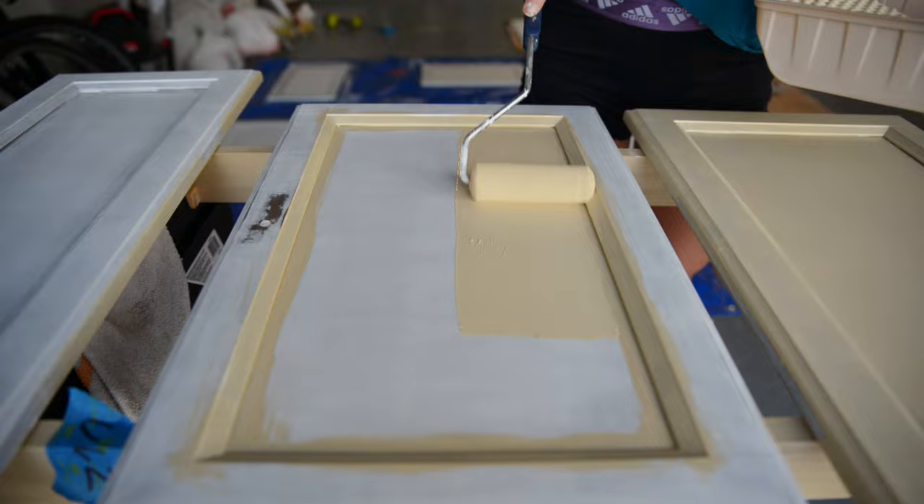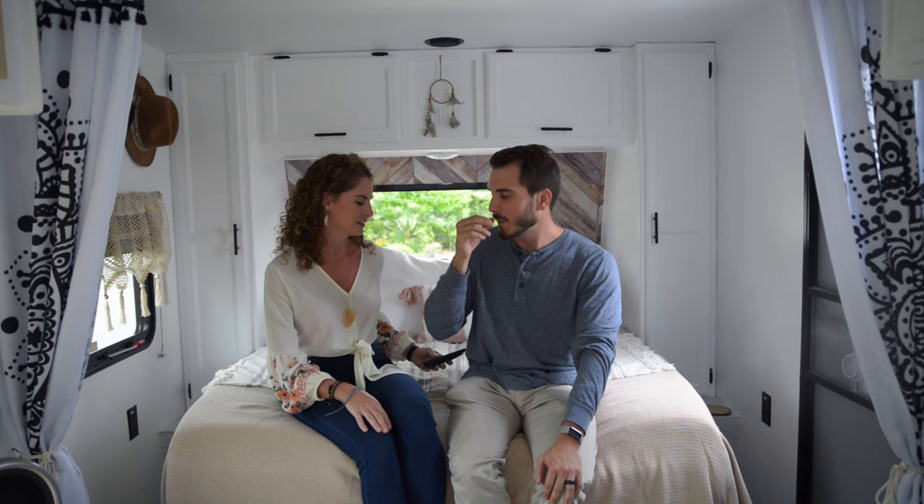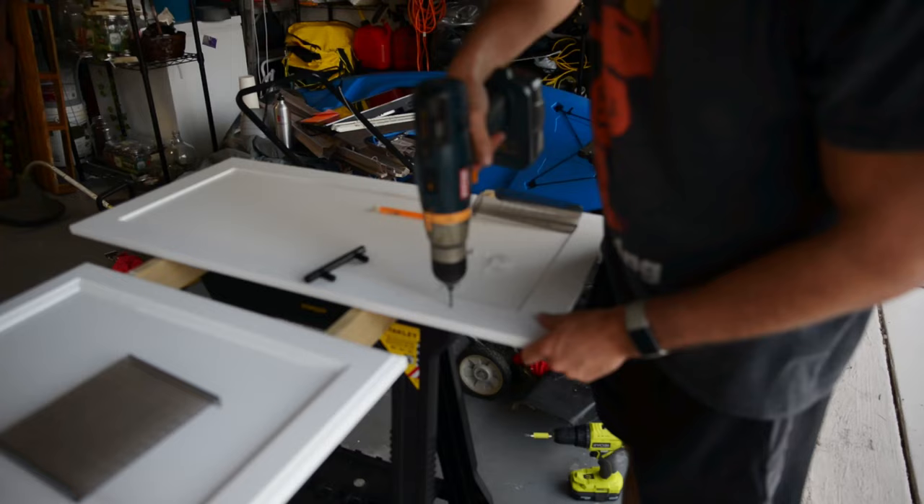Step number nine: after making sure everything was smooth, we added our two coats of paint. It was two coats for the off-tan color, but for the white it was more like three to four coats, and we even had to touch up more than that in some spots. White was a longer process — it doesn't have the pigment that covers as well, and our cabinets were very dark before. The paint we used, I wouldn't give it a huge recommendation — I'd do more research and find something better. It was something I came across on an RV blog and I feel like our lives could have been easier with a better paint, and it wasn't even that cheap.